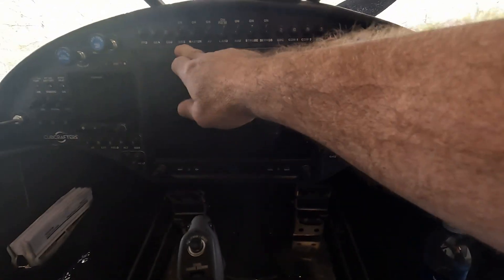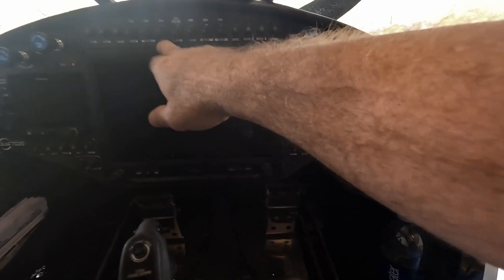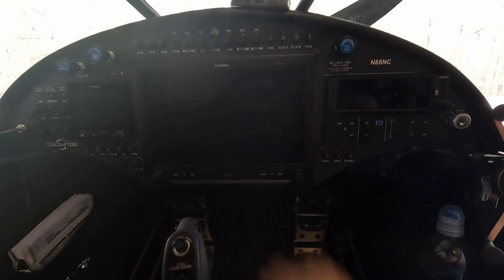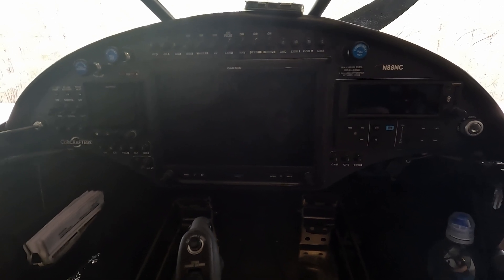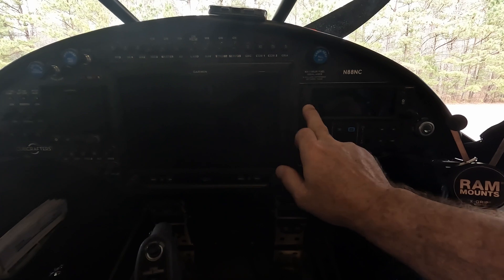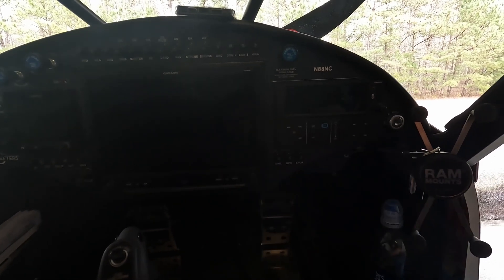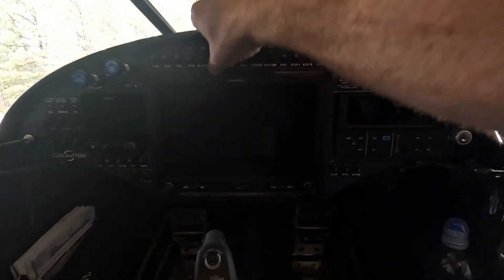If you're just doing the Garmin G3X, you can use IBBS only if you have IBBS. But if you're going to be updating the GNC 355, you need to have avionics on. Today I'm going to use master avionics. I've got the map updates in prior to powering up — both systems are going to identify that there's an update available. The G3X update has something like 8 gigs of map data and can take 15 minutes, so that's why sometimes an external charge source is good to have. The GNC 355 will offer to update if the maps are expired; if you're installing a day or two prior to expiration, it's a little tricky — you have to press the databases button and then preload them, so it's a more complicated user interface.